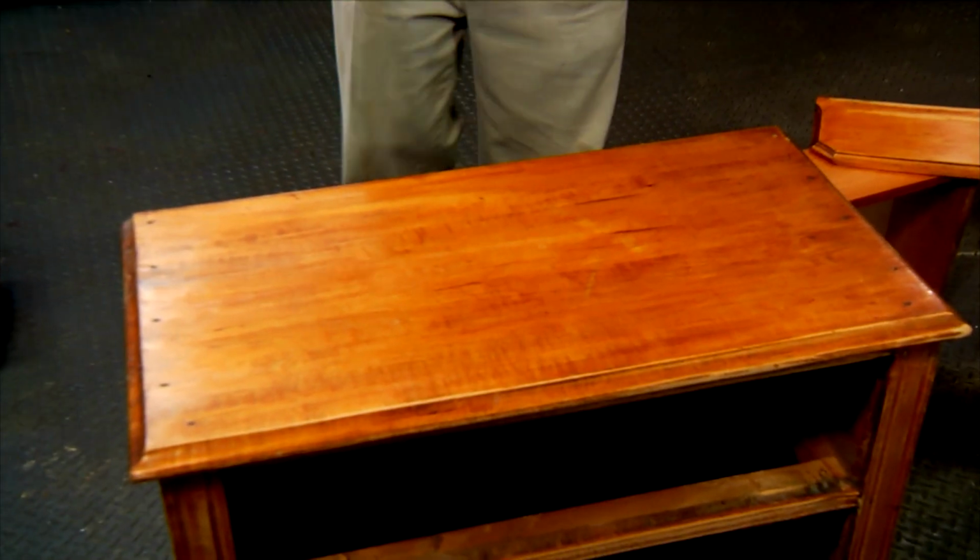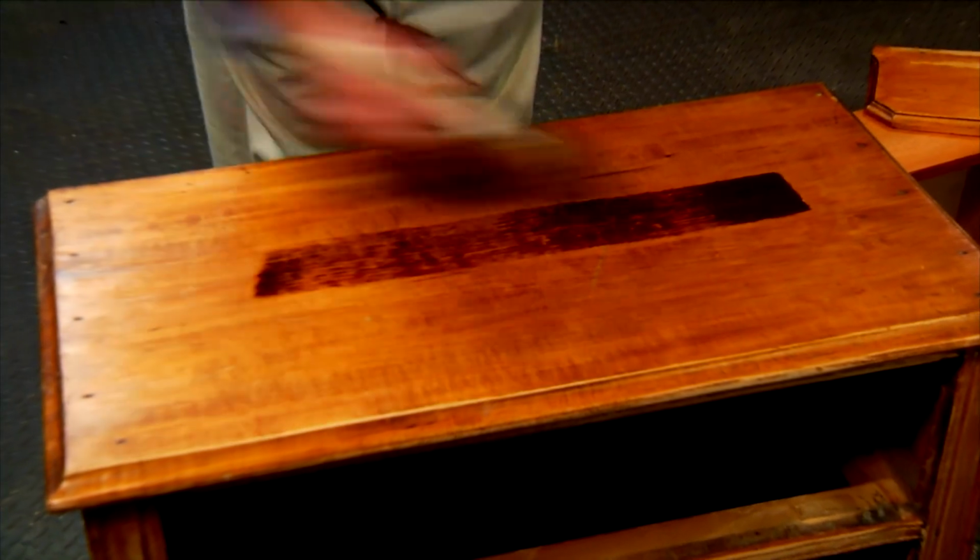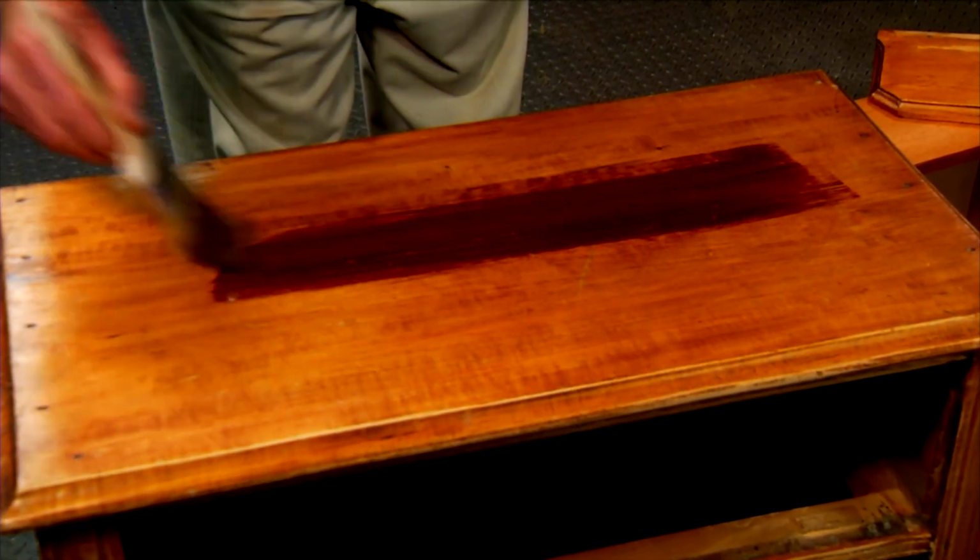I've noticed that the surface of this chest continues to have a somewhat slippery feel, despite the fact I've cleaned and sanded it. So I'm going to test a section for possible silicone contamination. Well, my suspicions are confirmed. These craters that are forming are caused by silicone that's penetrated into the existing finish and, in spots, is repelling the new finish I'm trying to apply.